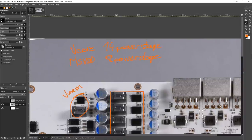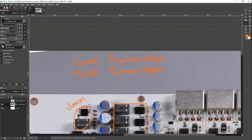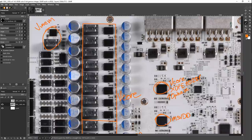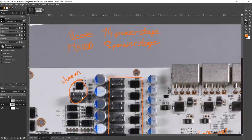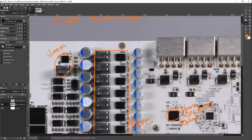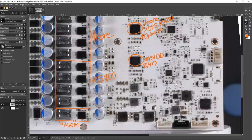The interesting thing about modern NVIDIA GPUs is that they don't have symmetrical phases. This is a 10-phase controller, but for V-Core, this card actually has 14 power stages. MSVDD doesn't do anything weird because it's a much smaller rail, so that's just eight power stages, which works fine. Both controllers are those XDPE 10281s. I still don't know how NVIDIA cards do this — running 14 power stages off of a 10-phase controller. Some phases have two power stages in them and some phases have just one, which is kind of weird. The controller has to deal with current balancing, intentionally shoving more current through the phases with two power stages.